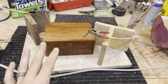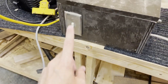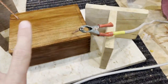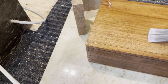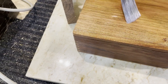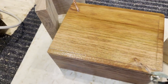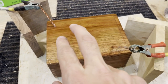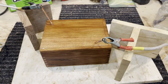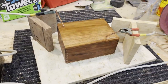I've let it sit for about five minutes and I've gone ahead and positioned my leads where I want to have this done. I have not plugged this in and have not turned it on yet — everything is still exactly as it should be. I'm going to apply a little more of the solution to the top and connect the two lead points where I want the lightning to try to work its way across and burn. What it should do is try to connect — the power is going to try to connect between these two and burn across the top.